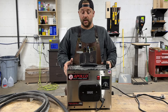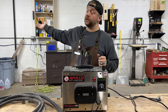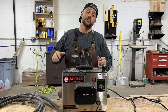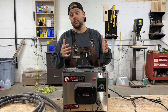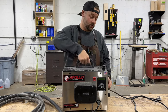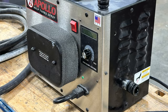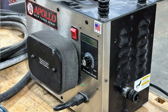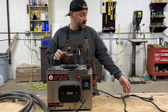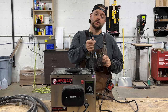It allows you to spray on site. We couldn't lug our 80-gallon compressor to a job site to be able to spray — you need a lot of air to spray when you're spraying out of a conventional gun. If we had to, we could take this — it weighs maybe 15 pounds — along with the hose and the gun to a job site and touch something up. No special power requirements for the turbine, just a standard 110 plug.